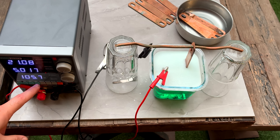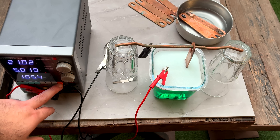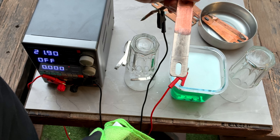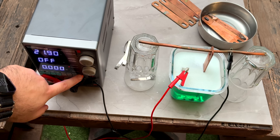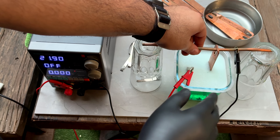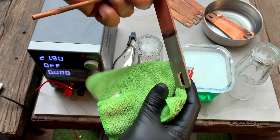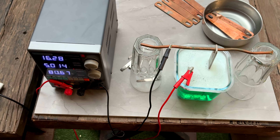It's been a few minutes and we're still getting five amps. I'll pause and check the bus bar — pull it out, give it a quick wipe, and you can see it's doing a fantastic job of plating. One side has a nice plate but the other side doesn't, so I'll reverse it and run it for another few minutes. I can see the wattage is dropping, which could signify it's more or less complete. Both sides are now nicely nickel plated.